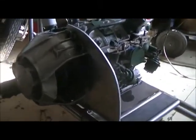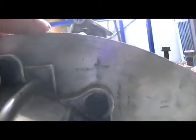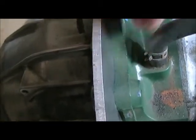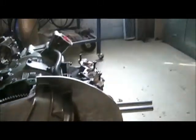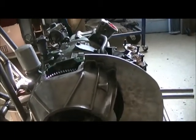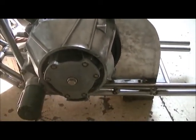And there we have the plate on the engine. There's 2 dowels on this. Actually, there's a dowel inside the housing that I drove in. It goes halfway into the aluminum plate. And then, of course, there's a dowel that's in the block in this one. It also goes halfway into the aluminum plate. So everything lines up really good on that dowel, and of course there's another one down on the bottom close to the starter, so it should be nice and solid and it shouldn't get a chance to move. The holes are very tight, you gotta wiggle a little bit to get the bolts in, so should be fine that way. There'll be no room for it to start to move.